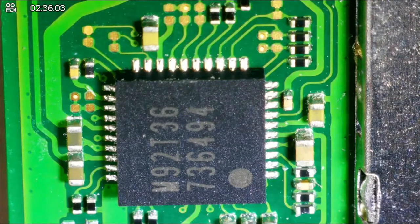It is an Xtronic 5040 model. Now, I have my air set to 350. What temperature would you recommend, Coder, on this hot air station? I'm going to set it to 400. Oh, 420. Wow, okay. Okay, 420 it is.